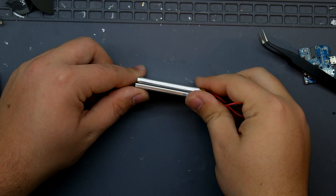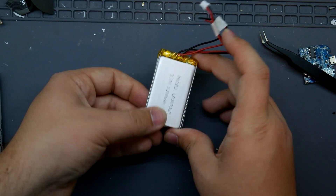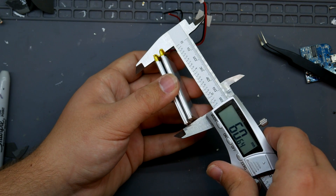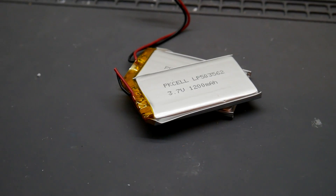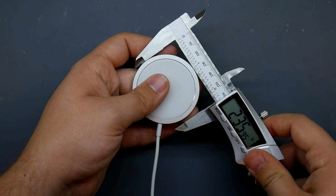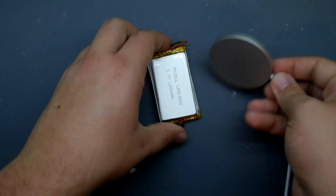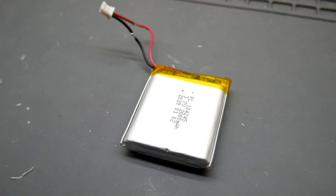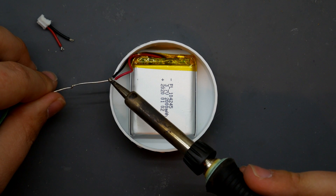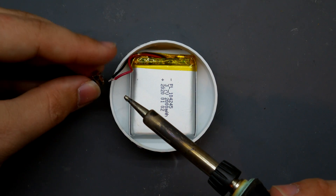I picked up a large lithium polymer battery. At first I was thinking I could use two thin batteries with 1200 milliamps each in parallel, giving 2400 milliamps. However, since I wanted this to resemble Apple's charger, I needed to keep roughly the same diameter as the original — any larger might be wider than most phones with MagSafe. So I ended up looking through my component drawers and found a lithium polymer battery from an older project. It has 3.7 volts and 2000 milliamps — less than the 2400 from two batteries, but still enough to adequately charge the phone. And it has almost the same size as the original MagSafe charger.